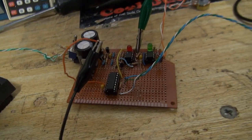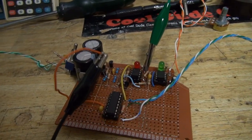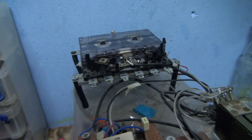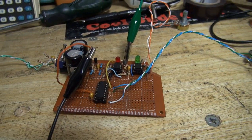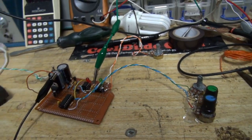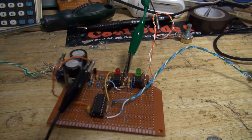Hope I haven't fried this chip, because right now it is grounded through the scope. This whole circuit's grounded through the scope. And I just so happened to touch pin 4, which is the output, while I was also touching this, and I got a huge shock. Such a shock it made me fart. I measured the voltage and we're getting like 210 volts there, so I don't know how we're getting 210 volts between two grounds. I just hope there wasn't enough current to fry this thing.